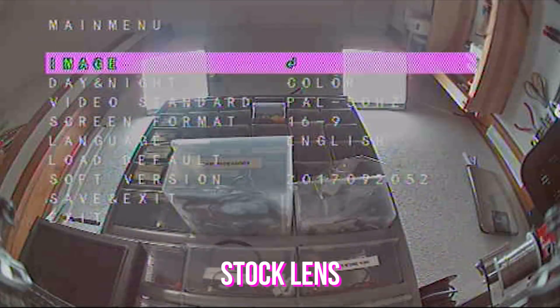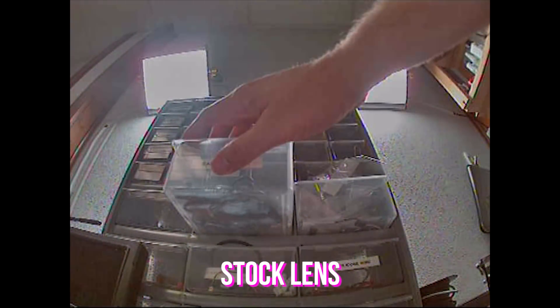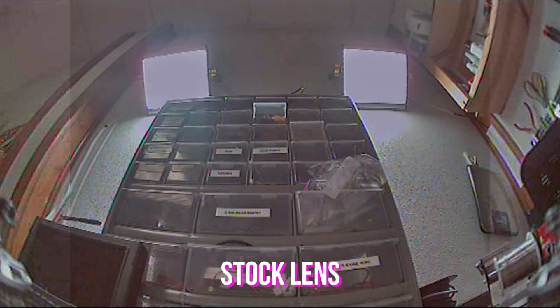Here's the stock lens and the camera is in 16:9 widescreen picture mode — 170 degree field of view. Now we switch it to 4:3 and we get the narrower 140 degree field of view. Let me show you something: I'm going to bring back the 16:9 image and you can see the camera is just slicing off the outer edges of the picture. When you go from 16:9 to 4:3, it literally just slices the edges off — that's why you get the reduced field of view.